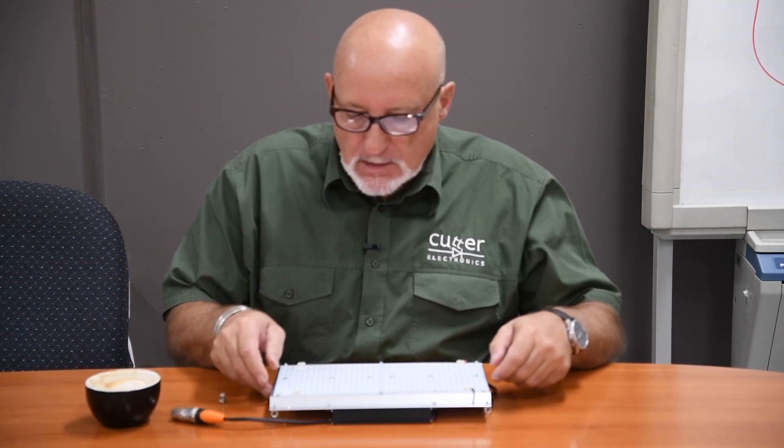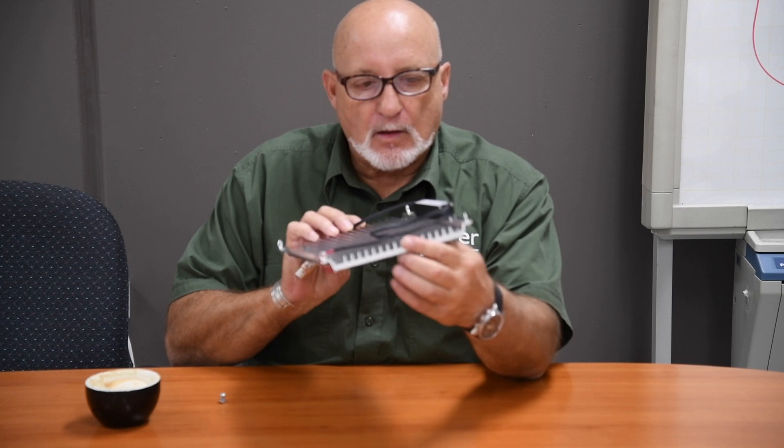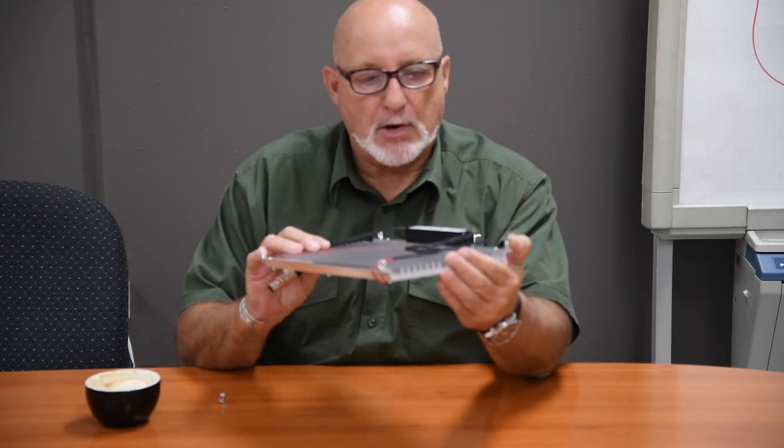The SSK 550 kit comes with these basic light engines — the LM301B board with 288 of the high-flux LEDs — mounted to the extruded heat sink, which has two flat edges. In this case we have some little eye bolts for hanging a single kit, and the extruded heat sink has various holes, some for routing wire but primarily for mounting to a frame system.